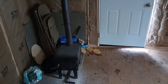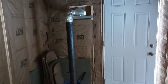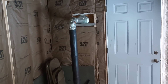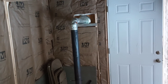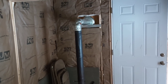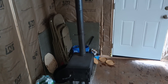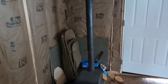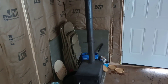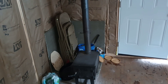Here's our Guide Gear wood stove that we put in. We've got three sections of the black pipe, then we go to the 3-inch double wall insulated pipe to go through the wall, and we used a thimble there. You can see we have a little bit of cement board here — we will be finishing this whole corner in cement board all the way up. That'll be the next trip project.